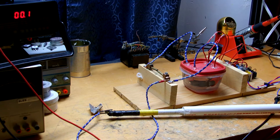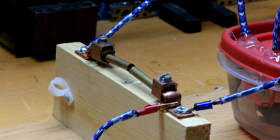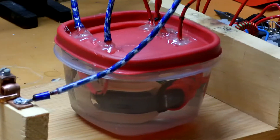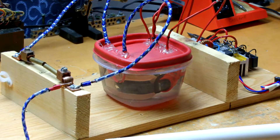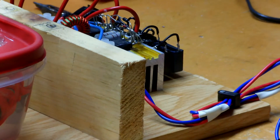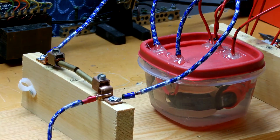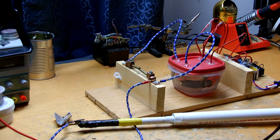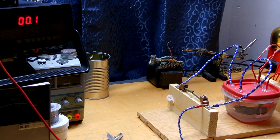Hey YouTube, just wanted to show you guys this flyback here. Finally have it worked out with a safety gap — seems to work out pretty well, decreases the risk of it arcing over to the conductors inside that container. There's a little ZVS driver over there, I'll show you guys that afterwards. I had to make a few changes to it, but in this video I'll definitely be hammering the poor ZVS driver, pushing it to just about 55–60 volts. I'll put that voltmeter right there on screen so you guys can see.